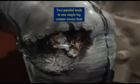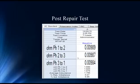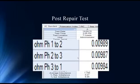Interestingly, this motor didn't actually fail, but it was on a variable frequency drive — kind of a double-edged sword. On one hand, variable frequency drives often control voltage through startup, reducing ongoing voltage stress and imbalanced fields within the motor. On the other side, transient voltage seen on the motor insulation does occur as the firing of the cards occurs, so there's a bad side to that as well. We then took a follow-up test once we repaired the connection, and everything is really restored back to normal — from a thousandth of an ohm change down to a hundred-thousandth of an ohm differential, less than one percent, a wonderful reading.